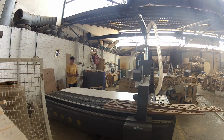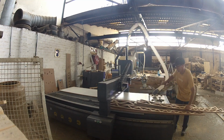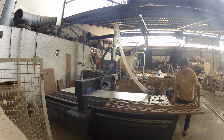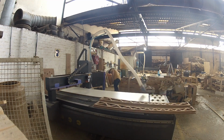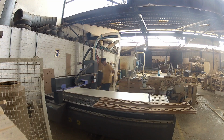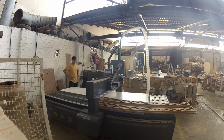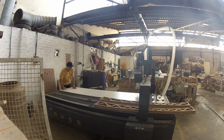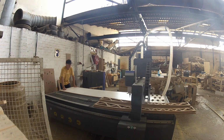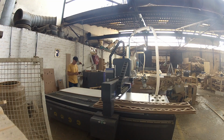So I've loaded up a 12.75mm tool bit and checked the Z height, and now I'm just doing a test pass, and good thing too, because we ended up catching these parts for the rocker table, which are going to be in the next video. But yep, this air pass is just being done 100mm higher than the stand, or what will be the final cut. And I'm just checking to make sure everything's going okay.